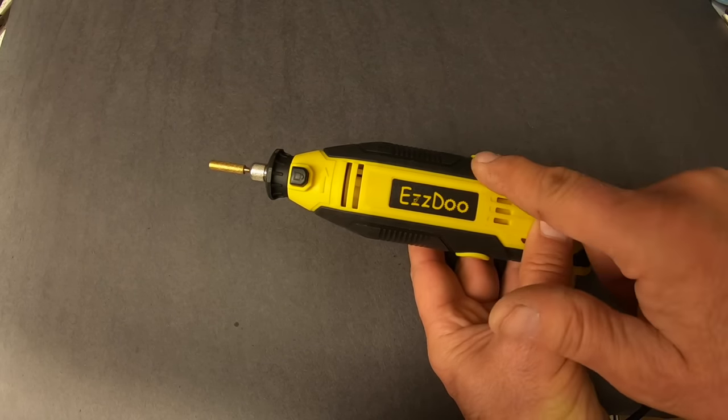But when I do take my depth gauges down, this is all I do. I've got to go to the right side here, so this is the opposite side of where I'm going to be pushing. I'd push this way, and when I do this side, I would be pushing this way. This is a Husqvarna, but you can use any kind of flat file that doesn't have teeth on the edge. You can see there's no cutting edge right here on the actual file.